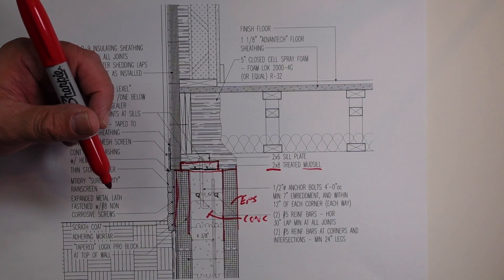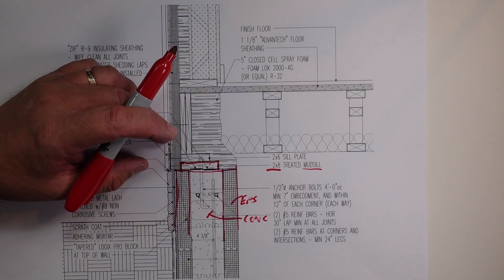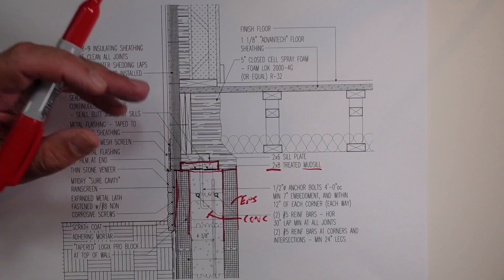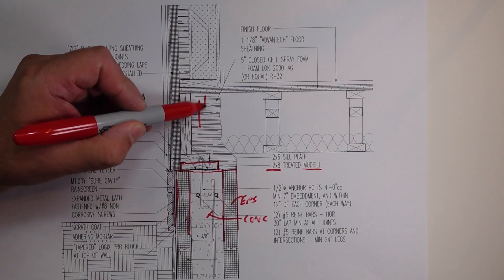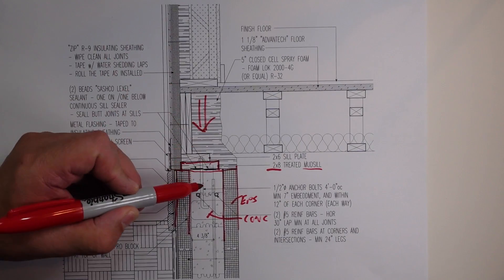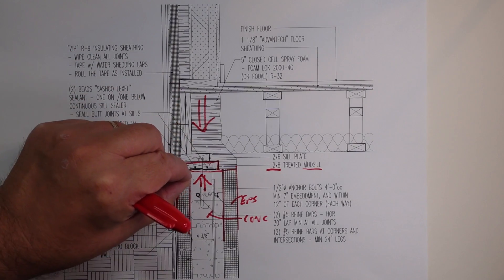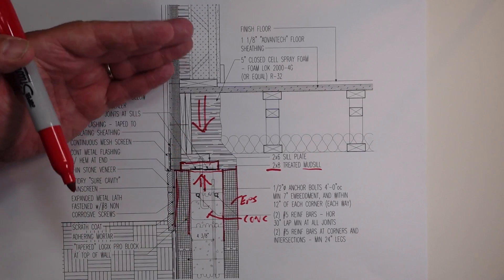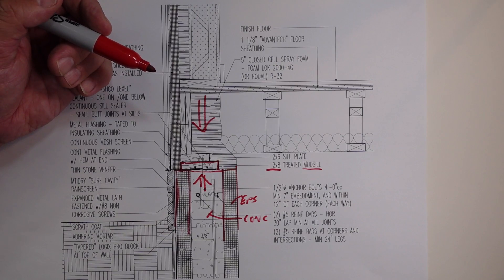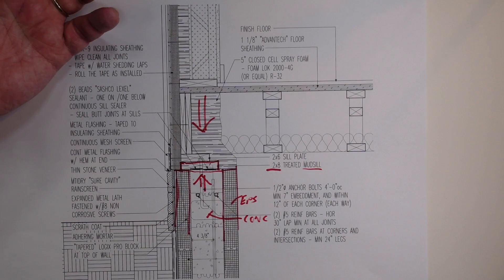Now I've been doing this detail — there are a lot of ways to do it, this is certainly not the only way — but it is a way I think is very effective. It uses the gravity of the house in our favor as it squishes it down. And because this is concrete, it's going to resist. So we get that nice, smushy sandwich where the house is pushing down on this, and it just never fails me. I like the detail; I think it works really well.